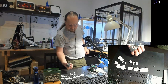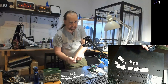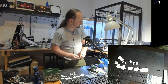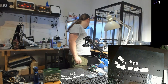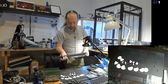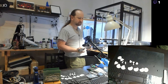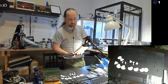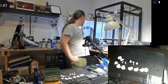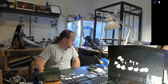And the lower mounts have two bearings in them, as well as an actual retaining mount on top of it. So it holds the bearings really well on the bottom mount. They could hold a significant amount of weight. And then I've got a couple of extra extrusions that I'm going to mount probably on the back of the printer, either on the back or somewhere near the bottom. I haven't fully decided yet. That's going to hold the platform for the power supply and the control board. I don't know if I want it on the bottom or on the back yet. So yeah, there's that.